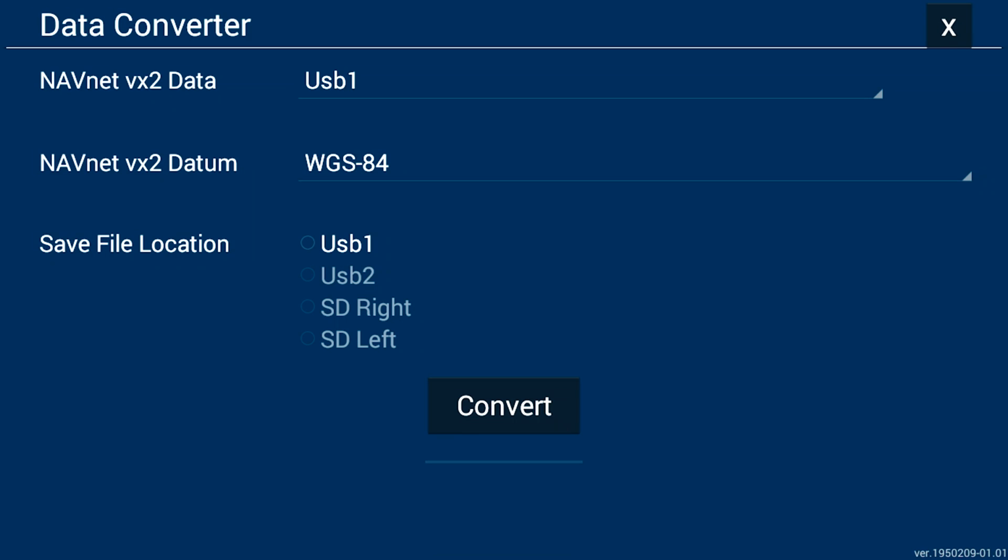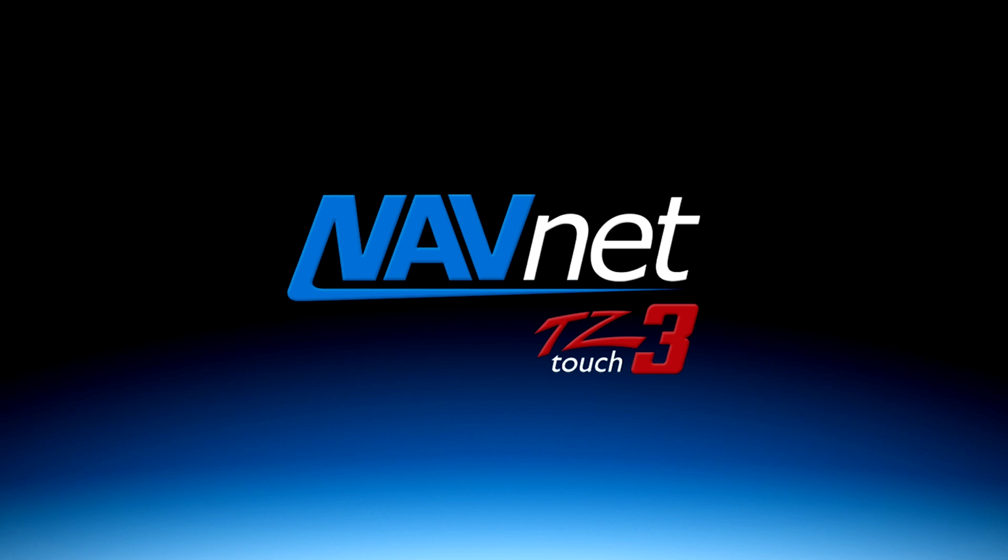Once the page loads up, ensure USB 1 is selected beside NavNet VX2 data. This is where it's going to look for our old NavNet VX2 points. Save file location, we also want USB 1. This is where it's going to put our converted files so that we can then import it into our TZtouch3. Then press Convert. You see the progress bar jump across. There's a successful message at the bottom, and we now press X to leave out.